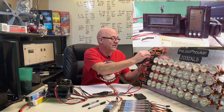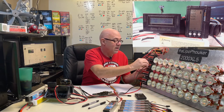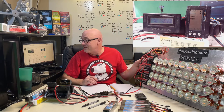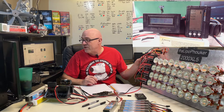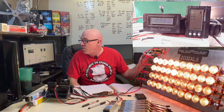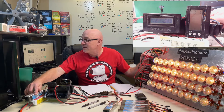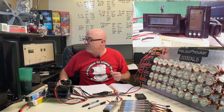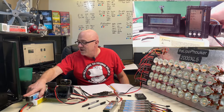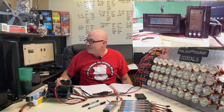So now let's put a bigger load under it and watch what happens - it's quite incredible. When I put this load on it, I'm guessing we could get down into the two-point-something volts on that cell. Let's see what happens. See cell number four - we're at 3.10, 3.6. Actually the other ones are diving too - 2.9, 2.8, 2.6, 2.4. Oh my God, 1.8. That cell is garbage. It got down to 0.05. And cell number four is really, really hot. But look - it's all recovering almost to normal. I'm going to run that test again. I've never had one go on fire from putting a load on it, I've only had them catch on fire charging them. But this is a reason - if you don't balance charge once in a while, you have no idea what's going on with your battery.